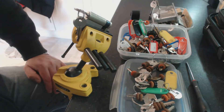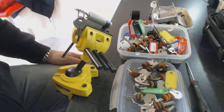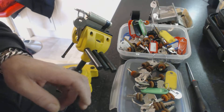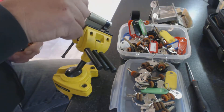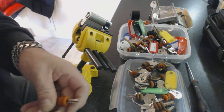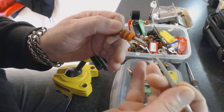Hi, welcome to Rowthorn's Locksmiths and Locksmith Training. Today we're having a look at bumping — bump keys. We've got this little six-pin half cylinder here with a working key, locked up. Now every now and again with your bump keys, because they hit the back of the lock, you need to take a file and just give them a small filing.